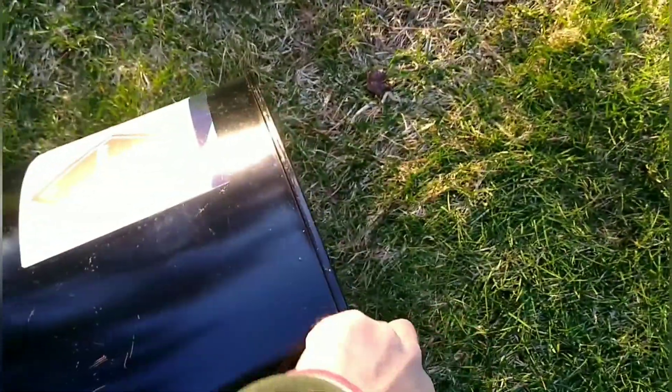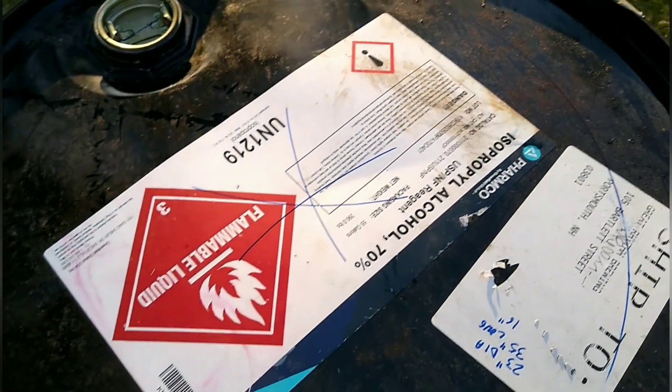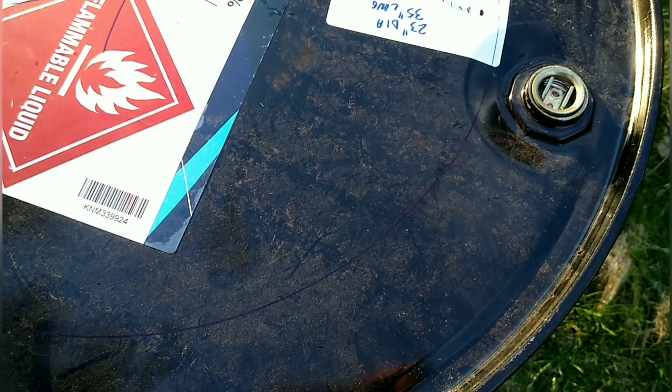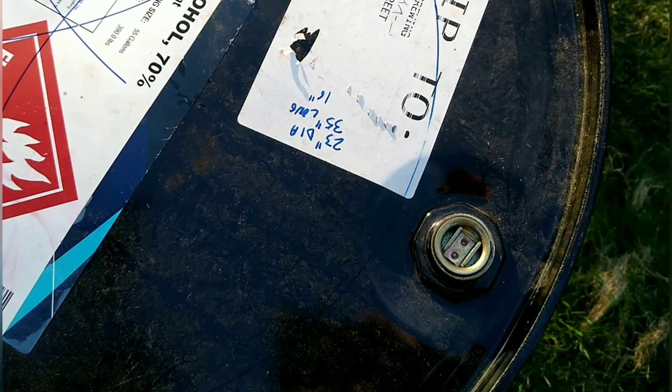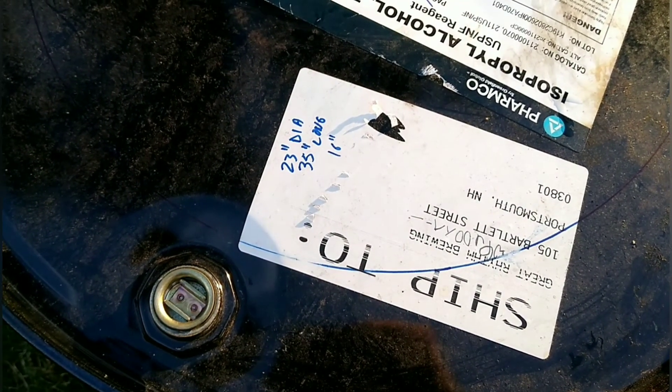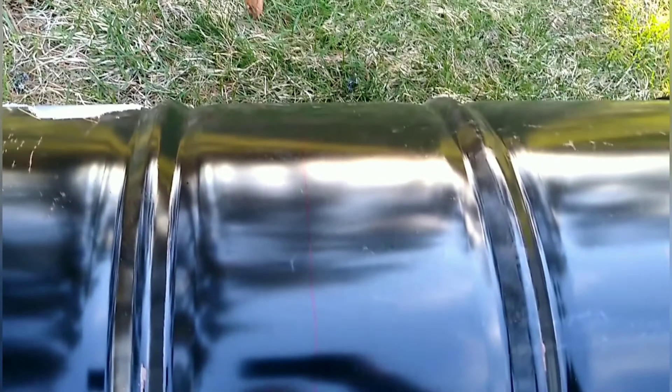To the other side — this top edge was a 14 inch diameter circle. I did the same process on the bottom side. Here's my 16 inch diameter circle on the bottom. So this is going to be the lower barrel that fits into the upper barrel. I made some notes here that this barrel is 23 inch diameter along the outside and 35 inches long. Half of 35 is 17 and a half inches. But in order so that the inside barrel is an inch and a half down, I went three quarters of an inch further to this side — so 18 and a quarter inches total from the top edge. This is where I'll cut the barrel.